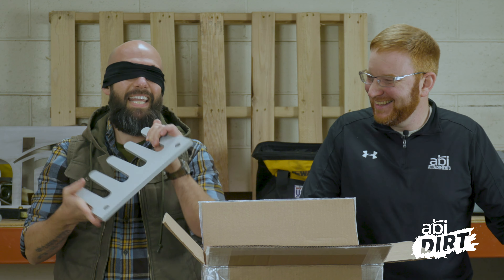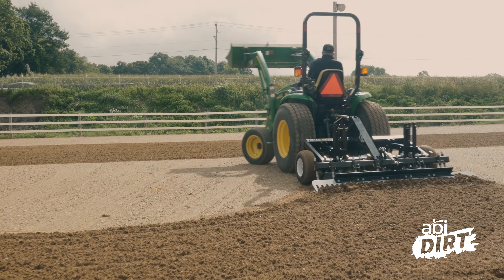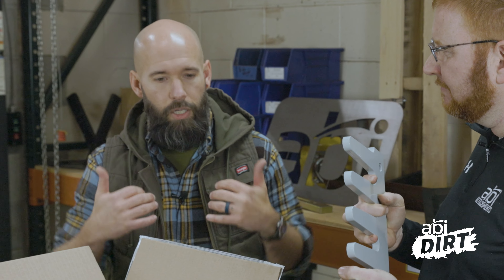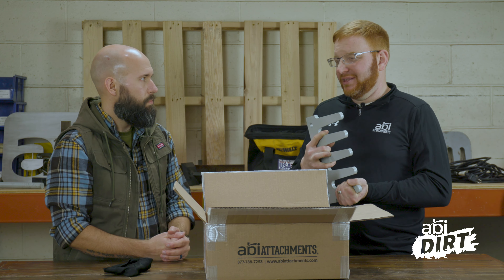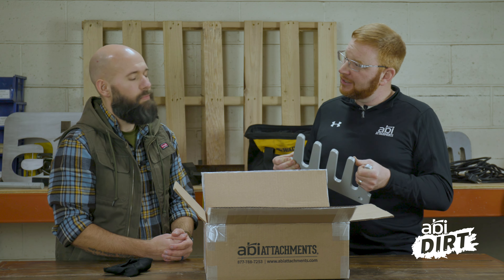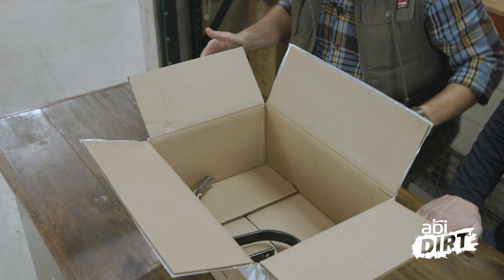70 gray to be specific. Yes, this is our finish rake. All of our tools in natural horse arenas finish with this because it feathers out, leaves a beautiful finish and does the right balance of leaving some air in the material but pressing some out of it. It's adjustable, especially on our TR3 E-Series that lets you adjust that to feather it out. The bend in the end is intentional so we get that nice feathered finish on many of our tools — on the far left and far right side on the E-Series. This is the TR3 E-Series as well as the Rascal line, and it can also be found on the underbody weldment of the ABI Force. On the TR3, the original tool, that's out of a much heavier material for contractor tools or SR3s — that's an abrasion resistant three quarter inch rake.